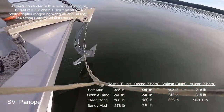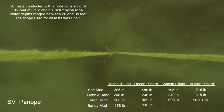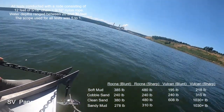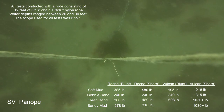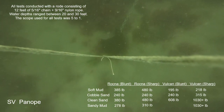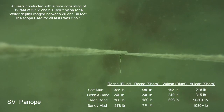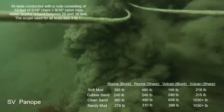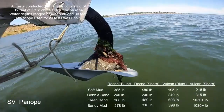Now for the Vulcan in the sandy mud. First try in the unmodified sharp leading edge condition — the anchor is just perfect, holding full boat thrust at over 1,000 pounds, buried completely out of sight. With the blunt leading edge, it's a completely different story. The anchor appears almost fully buried but the holding power just isn't there — 480 pounds fairly solid then a full release, and the next deployment was only 315 pounds before a full pop-out release at 380. More than half of its holding power has been sacrificed by adding that blunt leading edge.